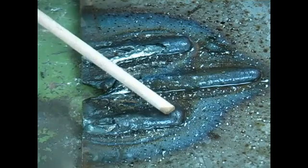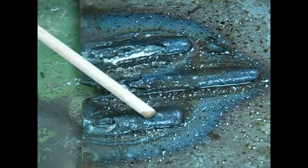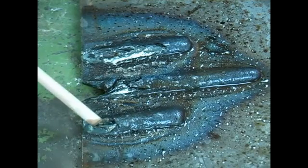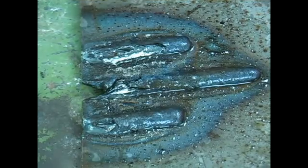With this one up here, what you want to do is strike your arc, bring it back, start your weld bead, and then once you get to the end, you want to make a couple circles, which will help fill in that end piece. Then you can pull your electrode off to stop your arc.